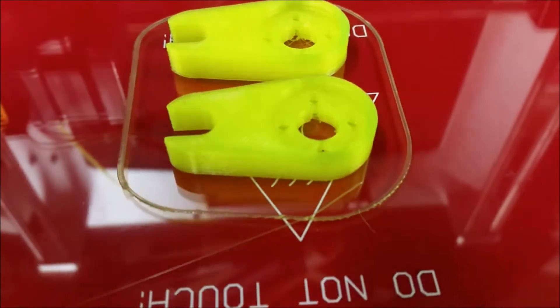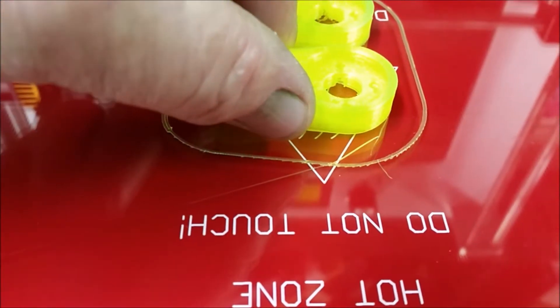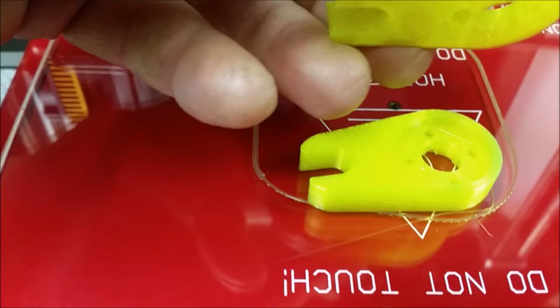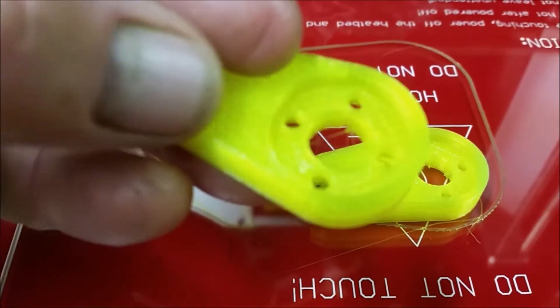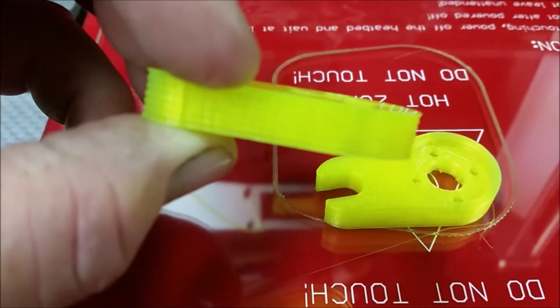Okay, they've just finished up. Let's take a look here and see the print bed's down to 35 degrees Celsius. It looks like they're coming loose now. I have not had to use any hairspray or anything on these yet. I've never had a print pop off the glass yet. So the heated bed's really working nice with the PLA.